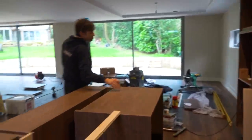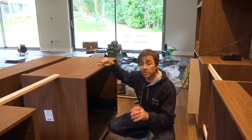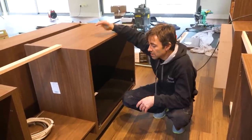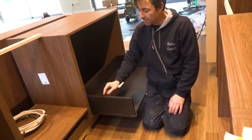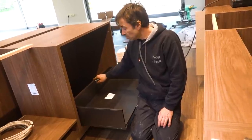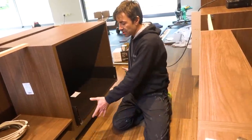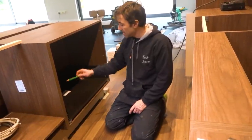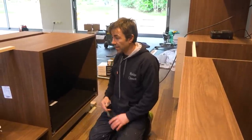I'm doing some drawers now using Legra boxes from Blum — superb products. Anyone in the furniture or kitchen industry will know Blum products. The Legra box has super-slim metal sides, a veneered chipboard back and bottom, and the front goes directly on top. I'm going to put one of these together because if you've not done one it's quite useful. All of these are pre-drilled in the factory, so it's a matter of just mounting the runners.